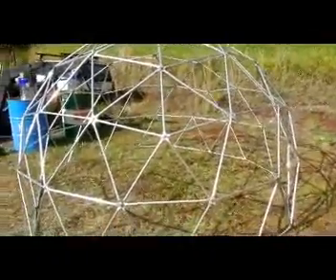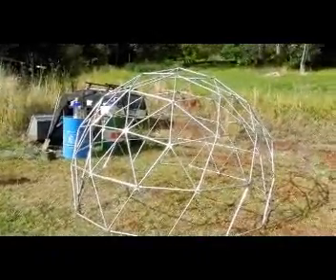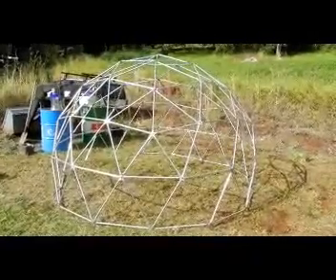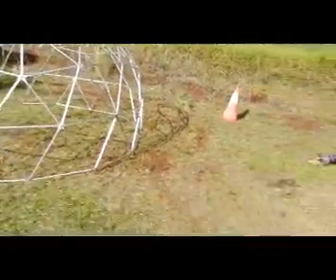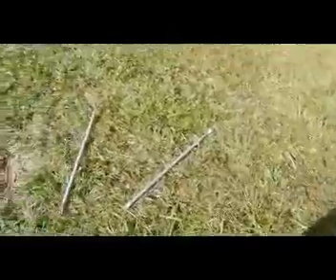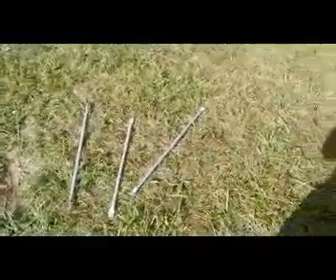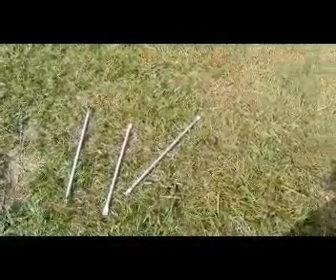What I did was basically put into the calculator — there's a place called Desert Domes, there are quite a few online, but I went to Desert Domes. They've got a calculator that allows you to calculate backwards. So I put in the longest section, which was the C section, and they were 650 millimetres long. That gave me a readout of basically how big a dome I could expect to get. The longest strut is 650 millimetres, but I've come in to 640, so there's a bit of meat there so I can drill a hole.